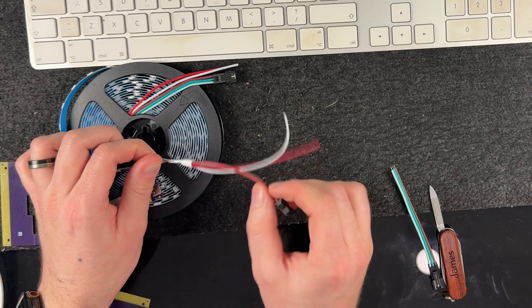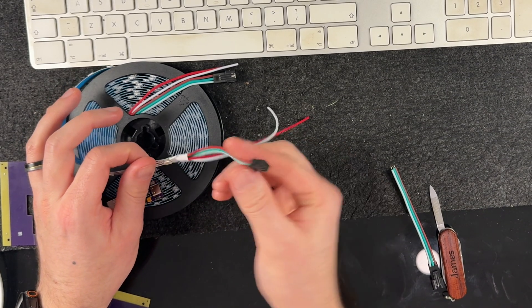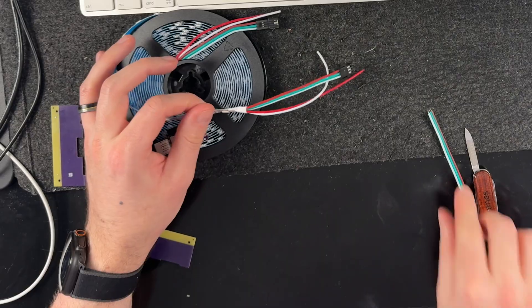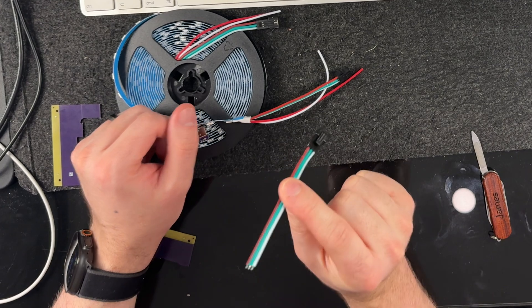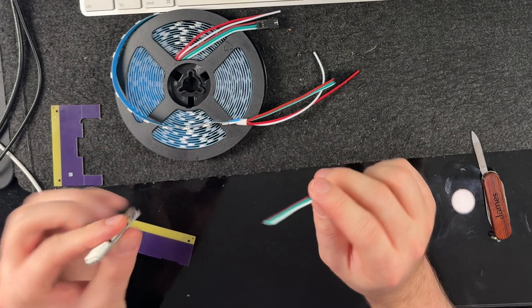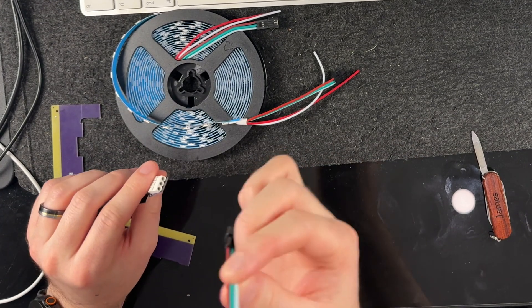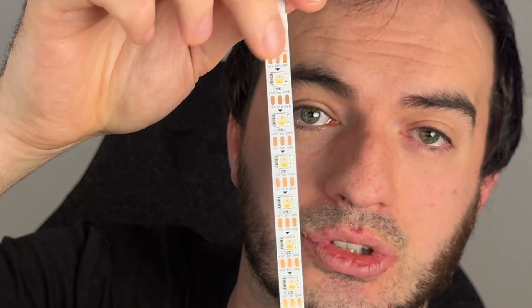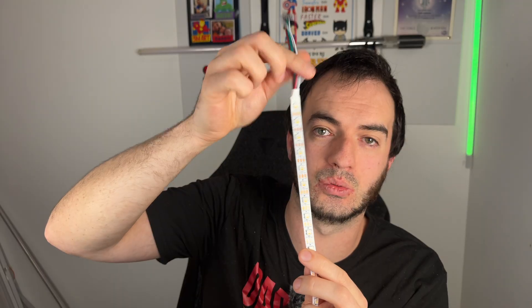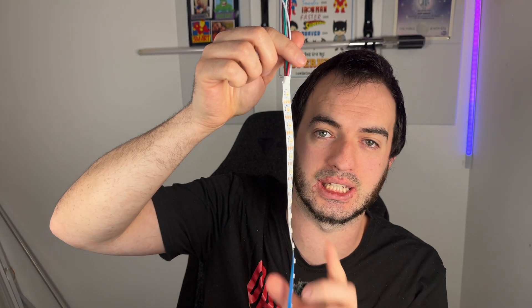They are often accompanied by extra red and white wires for injecting power from an external supply. These wires usually terminate with one of these JST connectors, and they often include the corresponding female JST connector in the box so you can easily wire it to the controller — they're usually even stripped back for you. It's also worth mentioning that addressable LEDs have a direction, so look out for the little arrows on the strip that denote which end is the beginning and which end is the end.